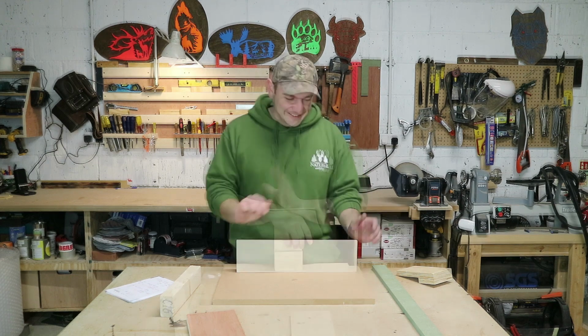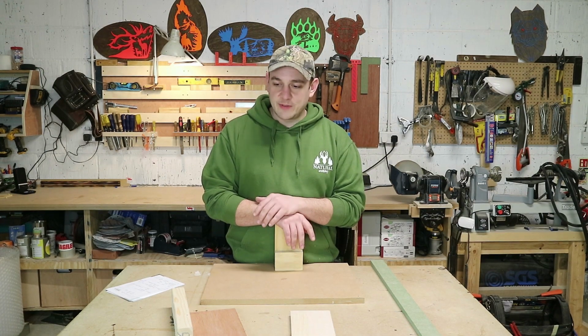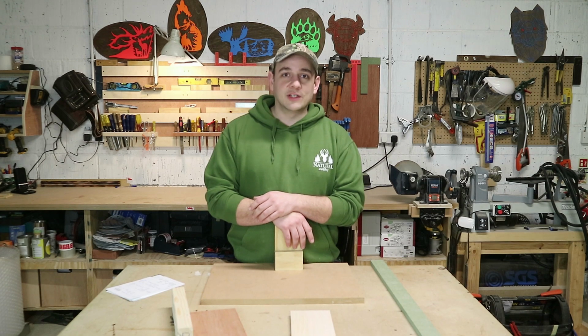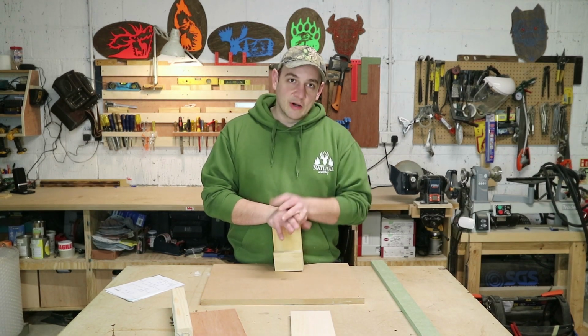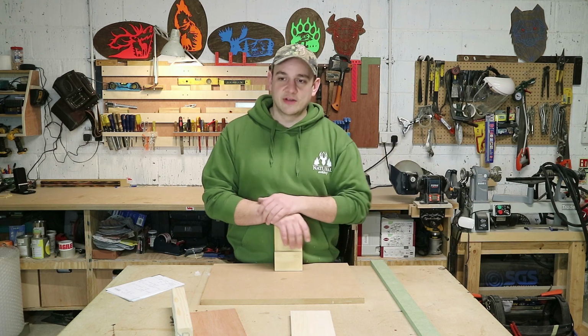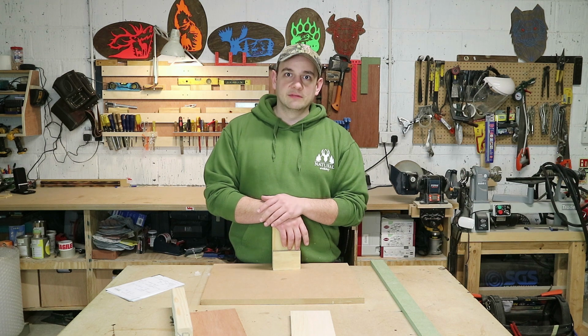Alright? I genuinely would be really interested to hear what you think. I know a lot of guys, especially over in the States, think I'm mad for using MDF the way that I do, but I do think it has its uses. And I think as long as you are making sure that you're using a respirator, you've got a well ventilated area, and you're using good quality dust extraction or cutting it outside because you don't want to be breathing the dust in, I love it, right?